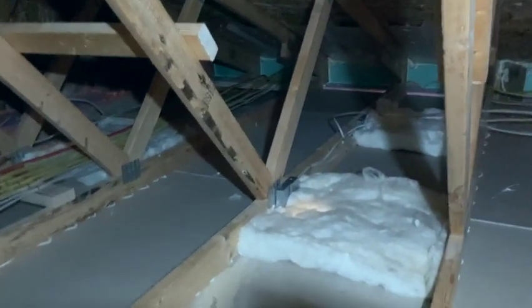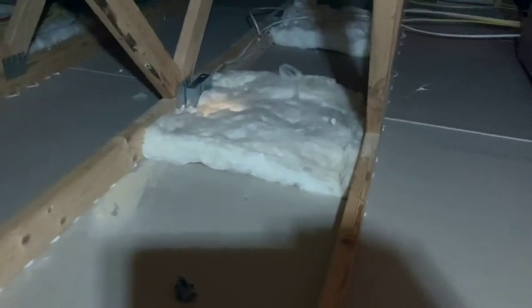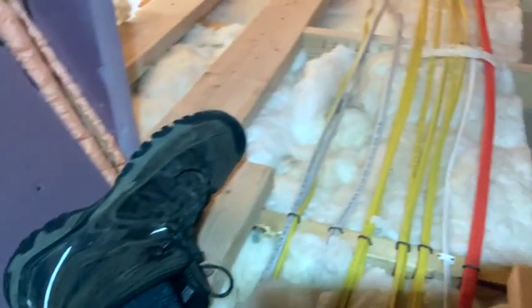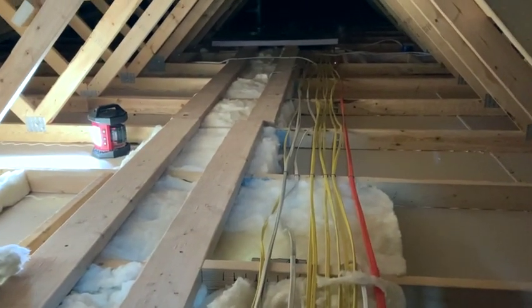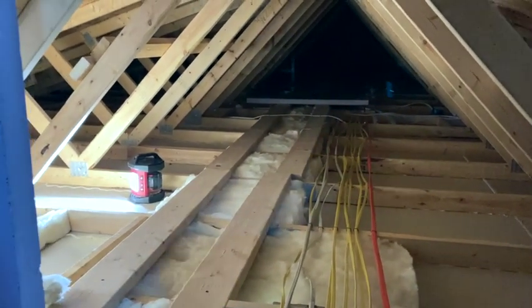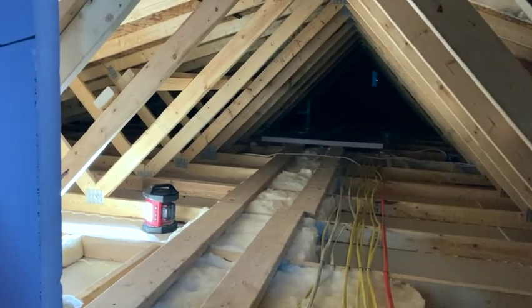All right, I'm above the front door up here, down below the attic. I'm putting insulation above all of these little circles we cut out for lights, so the insulation doesn't fall through, and I'm running any extra I have under these 2x6 runners, just to help fill that area in. You can see here is my skylight. I am super glad that I insulated that before we did the drywall on the ceiling. But if we look all the way down here, I've got all the lights covered, and I've run insulation under all my 2x6s so that we can walk across here and blow in the insulation. If I was 3 foot tall, this job would have been a breeze.